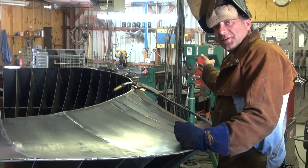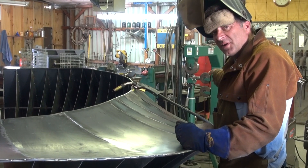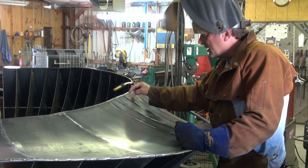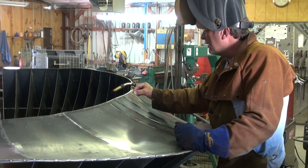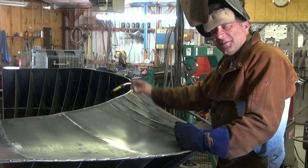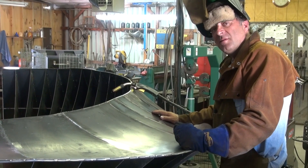So this is where the pulse control on that Longevity MIG Weld 250 comes in. I can set the pulse so I can come in here and work in this gap that's just a little too big, and I'm not going to blow through — hopefully — and I can fill that gap in, and come back with my grinder and just smooth it off.